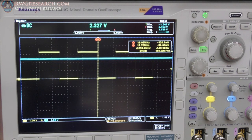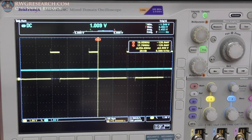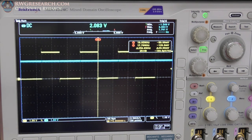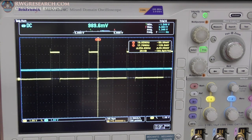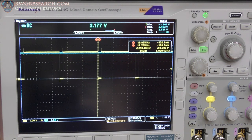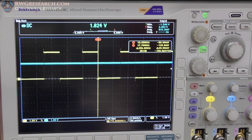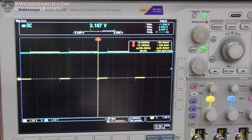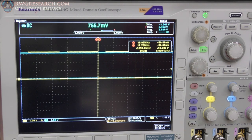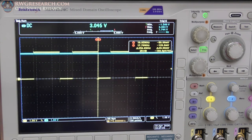What you're gonna see is this right here. I do not have any analog output pins on the BeagleBone. But what I do have is a pulse width modulated output. So I'm using a pulse width modulated output to make an analog signal, using the op amp as a buffer and a smoothing action. So you can see nothing really happens on the output after a certain point. The output stays at 3.1 and it maxes out. But I can't do anything else. I mean, the duty cycle's changing, but the output's not changing, is what I'm trying to say.